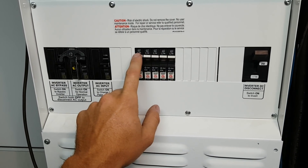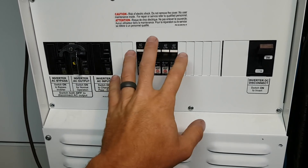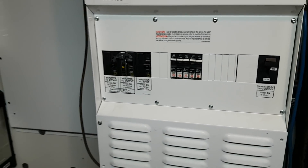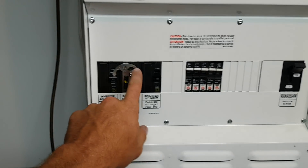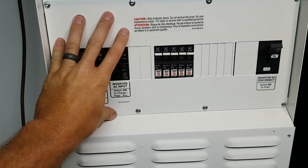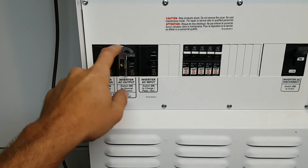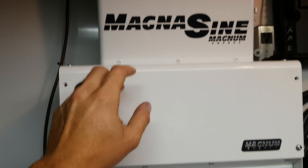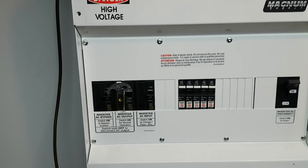I've now utilized all my breakers — they all have a solar panel or wind turbine. These are solar panels, that's the wind turbine, and this is solar panel. My house runs off a 60 amp breaker in here, which is the weakest point. Inside the house it's 100 amps, but when I get another inverter I may have to upgrade that to 100 amps.